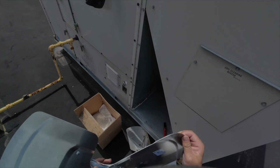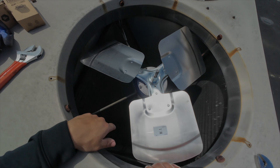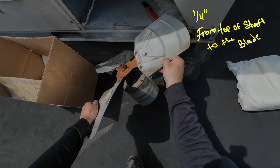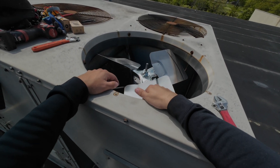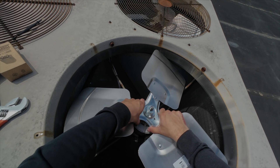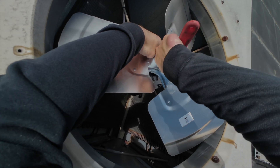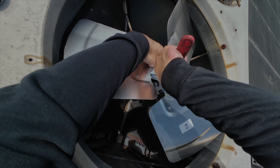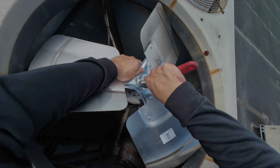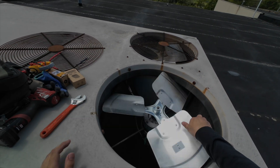There we go, that's perfect. You are going to want to line it up perfect. You always want to see how high the blade goes out — we got about a quarter, half a quarter of an inch from the top. Quarter of an inch, we will do about right there. It's always easier to change the blade with the condenser motor, but sometimes you can't do that — it's just the luck of the draw. Sometimes you got to reuse the same blade, which is why they make pullers. Invest in a good puller.